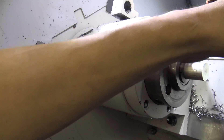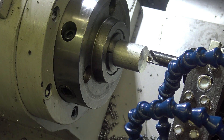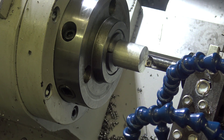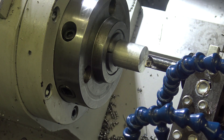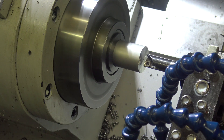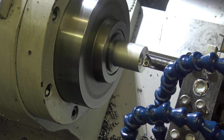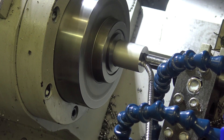Now plunge drilling — this is what's awesome. One sort of strange thing is that you don't drill at X zero. You drill at least 20 thou off center. Right now I'm 20 thou south — X negative — of center, running 1200 RPM. I'm going to go about 4% on the PathPilot jog, which works out to 2 thou per rev. Ready — boom. Look at that, not even pecking. Now I'll peck.